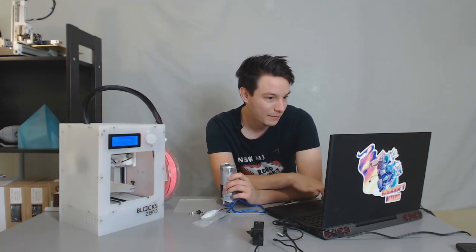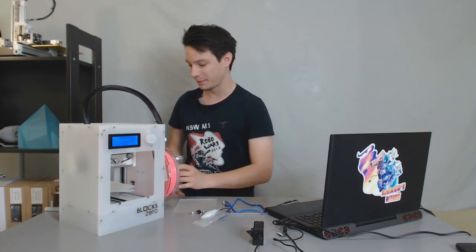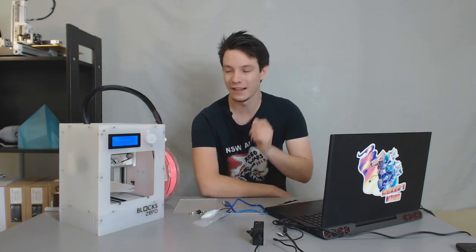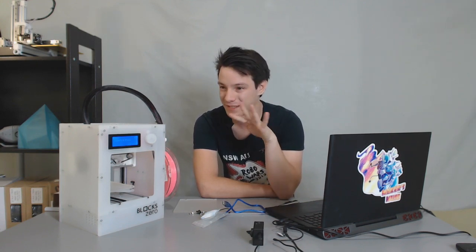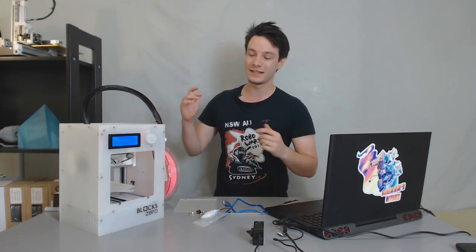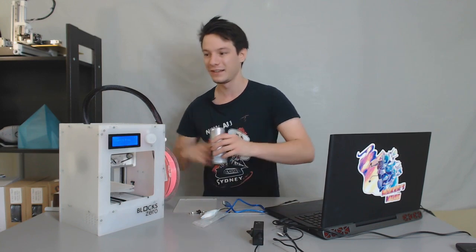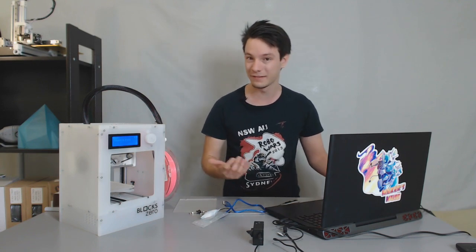Luke, polycarb doesn't laser very well. No, it doesn't actually. When I was wanting to use polycarbonate for robots, I looked at laser cutting it, and polycarbonate carbonizes. When you laser cut it, for a start, it makes massively toxic fumes, but it actually burns, and it makes this yellowy brown edge, which is really unsightly. So that's why you don't usually see polycarbonate being laser cut. In industry, you usually see it being CNC'd, but you can still laser cut it. Some companies will do it, and it's a stronger option. So some machines will have a cover that's laser cut, and if you look at the edge and you see this yellowing, then you know it's polycarbonate. If it's not yellowing, it's usually acrylic.